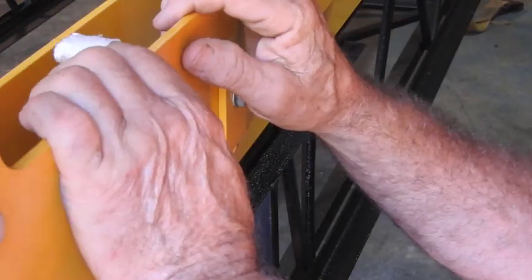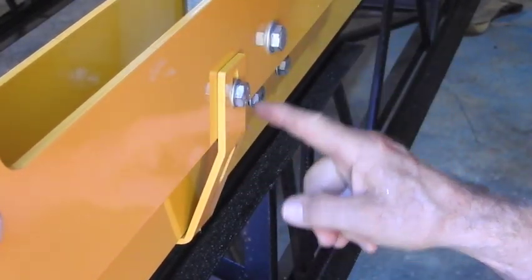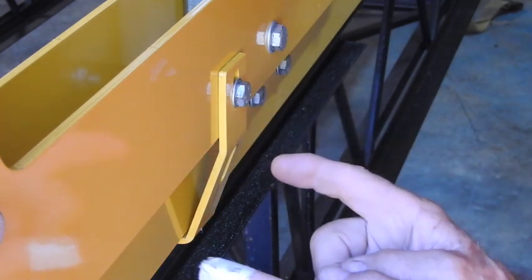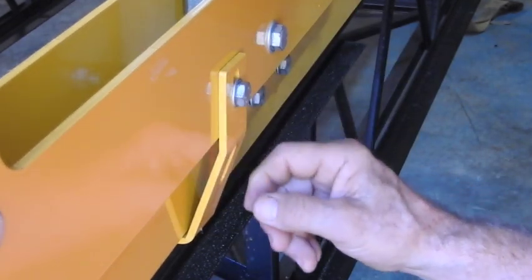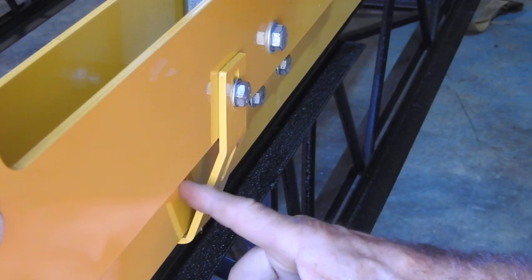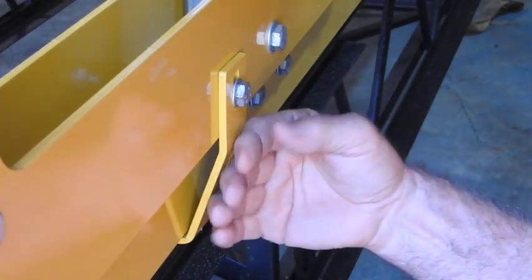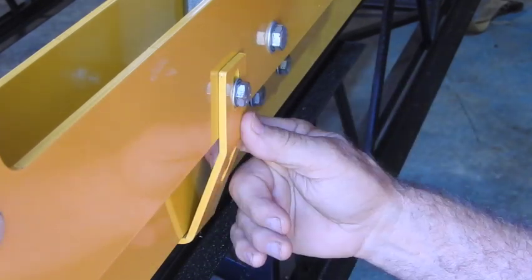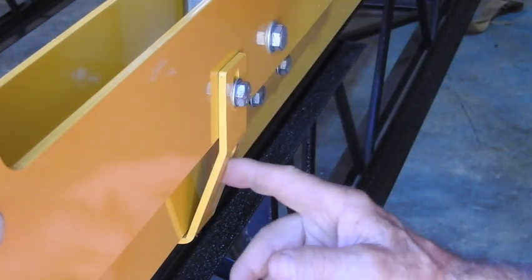Now, as far as securing the saw head to the bed frame, if I read the directions correctly, I think one of these bolts here down the side rail is supposed to be left out, right in front of the axle, and you're supposed to be able to bolt a long bolt all the way through this angle right here and then put a nut and everything on it down inside there. But what I'm going to do is find a position that suits me for travel, drill my own separate hole, and make a wedged washer that will square this up, so whenever I draw that in there, the wedged washer will hold everything perfectly square and tight and not put any pressure sideways that might have a tendency to work loose over the course of a 30, 40, 50 mile ride. So that's one change I'm going to make there, too.